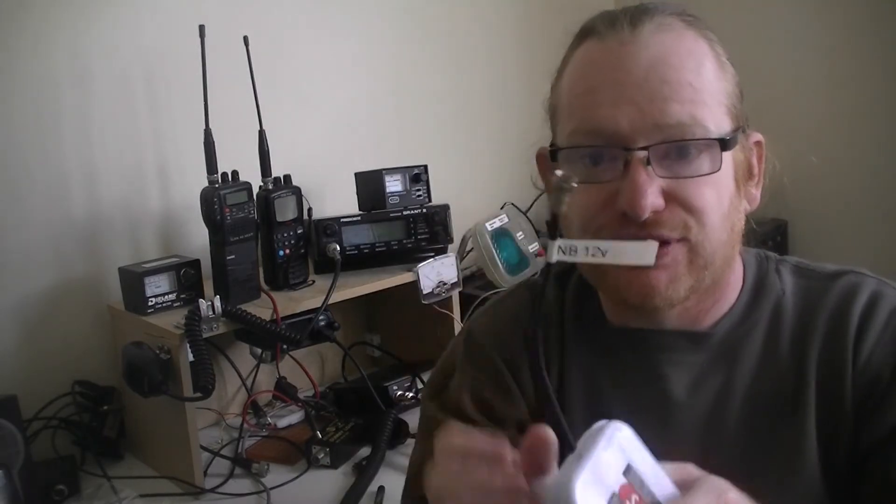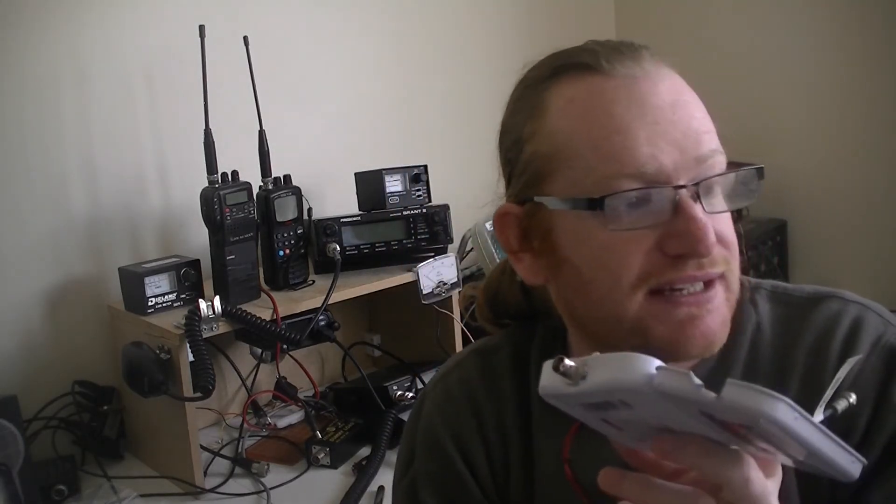The parts I used are an off-cut of coax cable that was attached to that LNB because I actually found it as scrap — I salvaged it and tested it and it still worked. A piece of scrap Vero board, a terminal block to connect the wires inside because I've got slightly thinner wires — the current's quite low so that's okay. A piece of stiff metal wire, as short as I possibly could get it, to connect to a BNC chassis socket which I removed from my slightly modified Intec DRS5070 PMR446 base station — I think I've blown the finals in that and need to repair it.